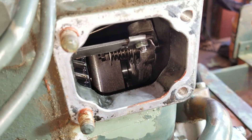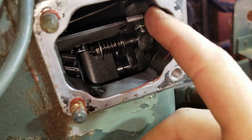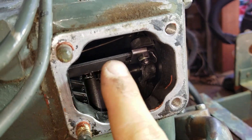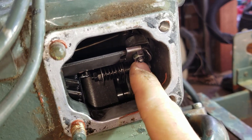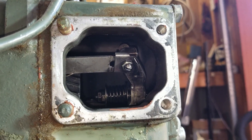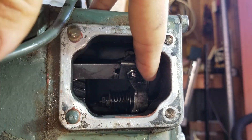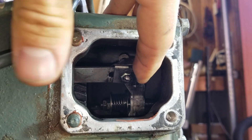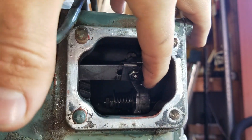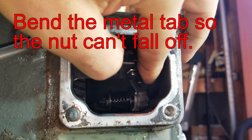So you see there's the shaft that comes out the front, there's this linkage arm, and then there's another one here. And there's an adjustment screw here. The manual mentions this screw — it says to loosen it and then push it all the way like this, because this has got a slot in it so it slides back and forth. I got that thing pushed all the way towards the driver's seat and just tighten back down.